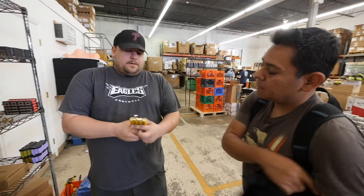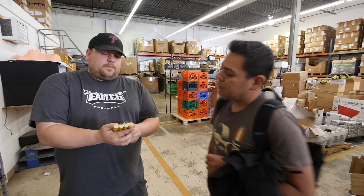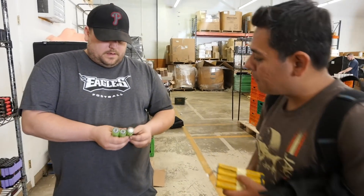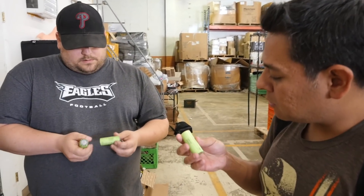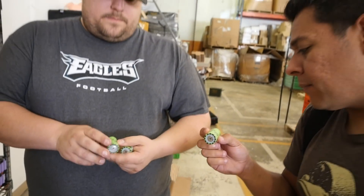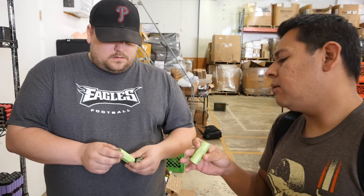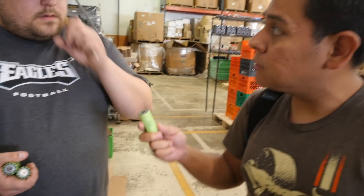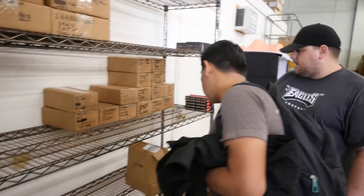These have lead wires, positive and negative. If you take two of them back to back and put a screw there, you've got a 48-volt pack. These are 30-amp A123 cells and here are the balance leads. These are A123 2500 milliamp cells — slightly better than the normal ones we were doing. We used to have the M1A, the older model, and these are the M1B — 50 amps but rated for 2500 milliamp hours. A little less power but more capacity. We cracked one open to spot-test everything and make sure they hold.